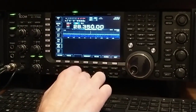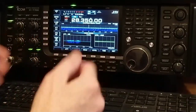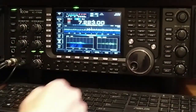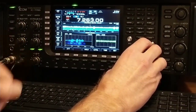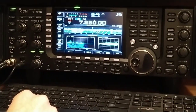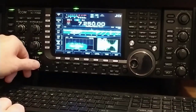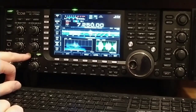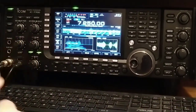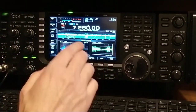There's also a preamp. Now I'm going to put the audio scope back up — you hit F6 to bring up the audio scope. I'm going to switch to 40 meters, take the tuner off, and find a frequency with someone talking. Without noise reduction it's not too bad because they've got a pretty good signal, but watch the difference when you press NR — the noise reduction takes all that background static right out and you can hear people a lot better.